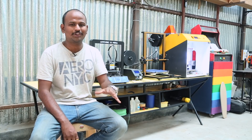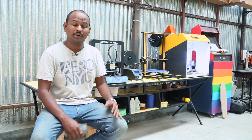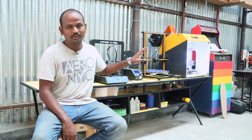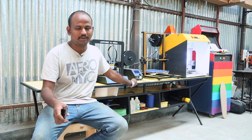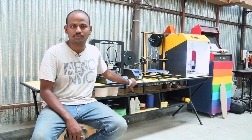So what did I learn from this build? Lots and lots of welding — the best way to learn something is to actually do it. What would I do differently next time? I'd use 30mm or 40mm square tubing, as that offers better stability for such a long table. With 20mm it's fine up to a four-by-two foot table, but if you're going longer than four feet, I'd suggest thicker square tubing.